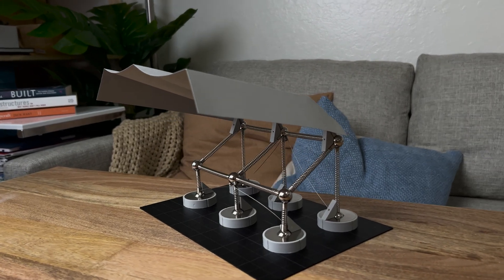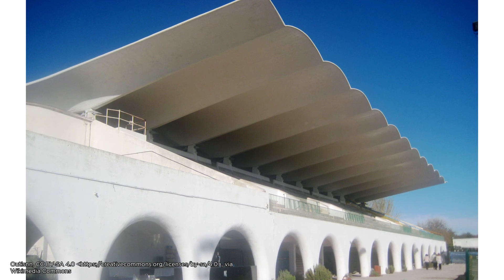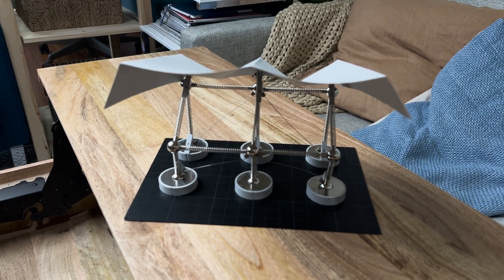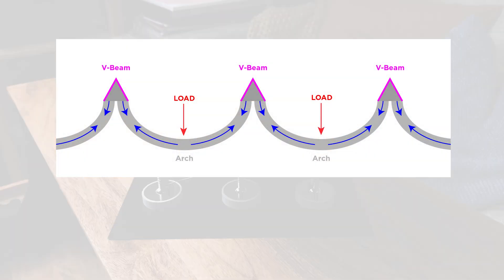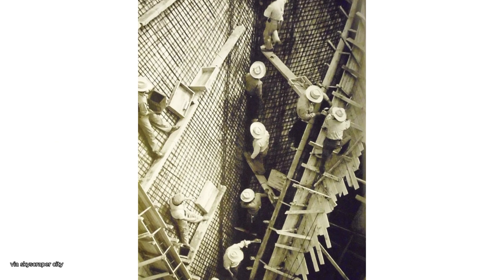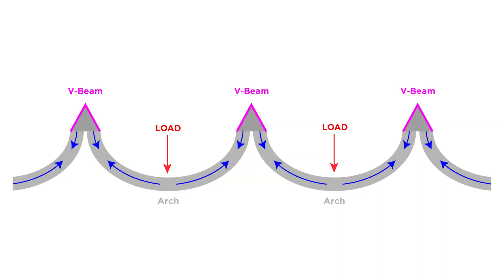This paper-fold structure is also included in the MOLA 4 kit. This structure is very similar to Spain's Hipódromo de la Zarzuela, and its curved roof is actually made from concrete. This works by stacking simple structural elements on top of each other. First is the arch that makes up most of the roof. Those arches then sit on top of a beam — in this case, the V-beam, the part where the arches intersect and connect. That section takes all the load and is the most heavily stressed part, so there's often a lot of steel reinforcing in it. The V-beam then transfers all the roof loads to the main structure. So you can simplify this complex shape by combining the structural concept of an arch supported by a triangular V-beam.